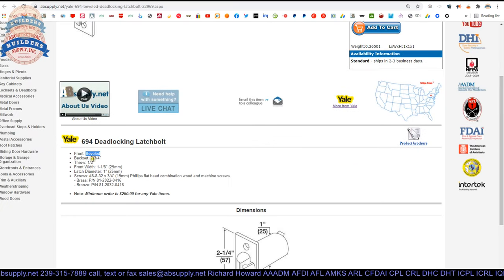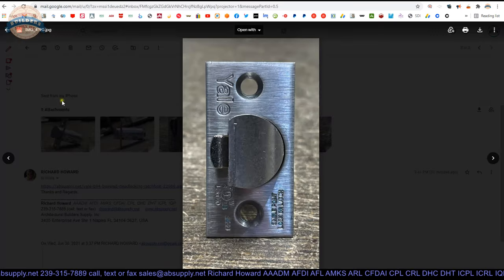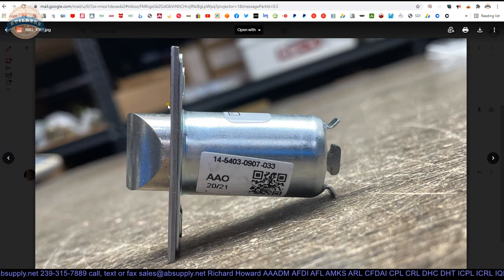Beveled front, two and three quarter, and it has a half inch latch throw — that's really important. That is half an inch, which is almost okay in every application but not all. The label on your fire door might say half inch minimum latch throw or three quarter inch minimum latch throw. If you have a label that says three quarter inch minimum latch throw, this latch bolt is not okay — and that's generally on a pair of doors.